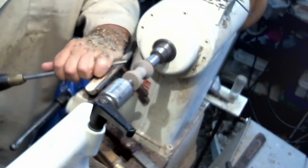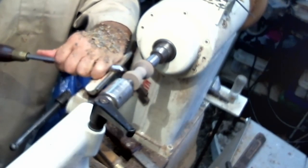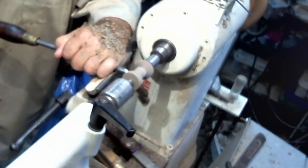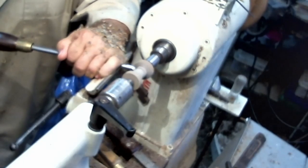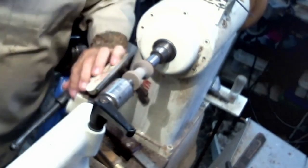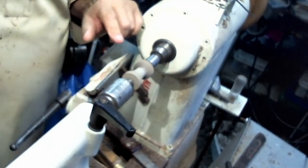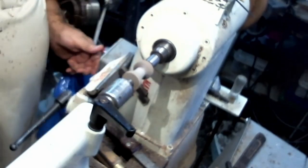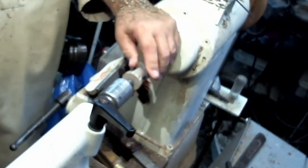It was all slicing cuts. If I was going with the tool flat with the V straight up, it would tear this thing apart. So I rolled it over on the edge, got a good slicing, and moved in there. Well, I don't want to go up hills. This is about halfway where I want to go for shaping. I hate the way these cameras are working right now. But I'm very coarse. I've done all slices, and I don't have any holidays or voids down through here. It's cutting up really nice.